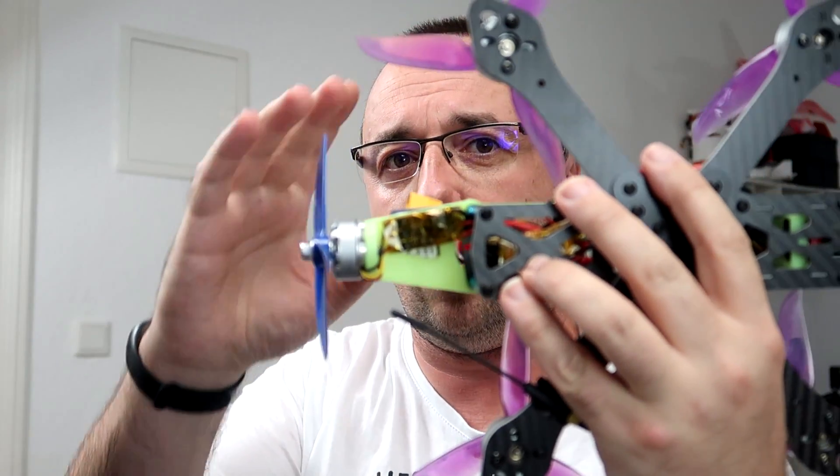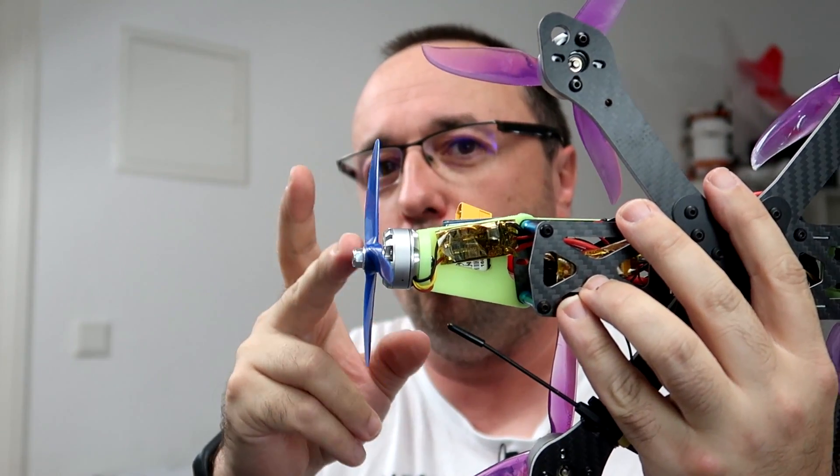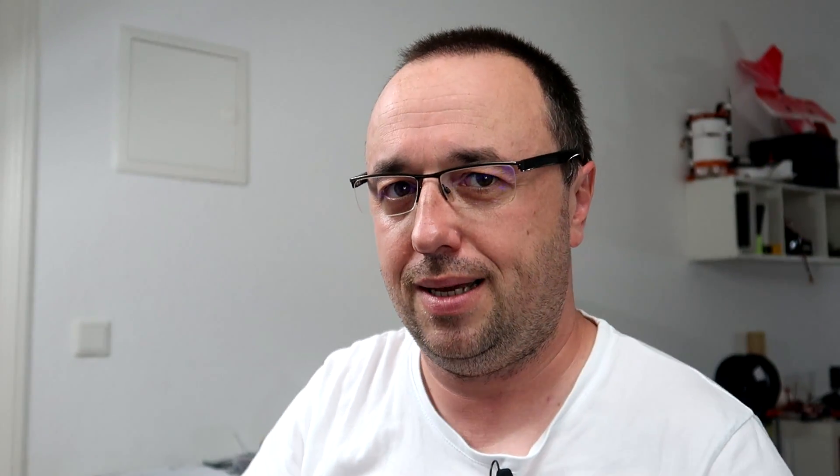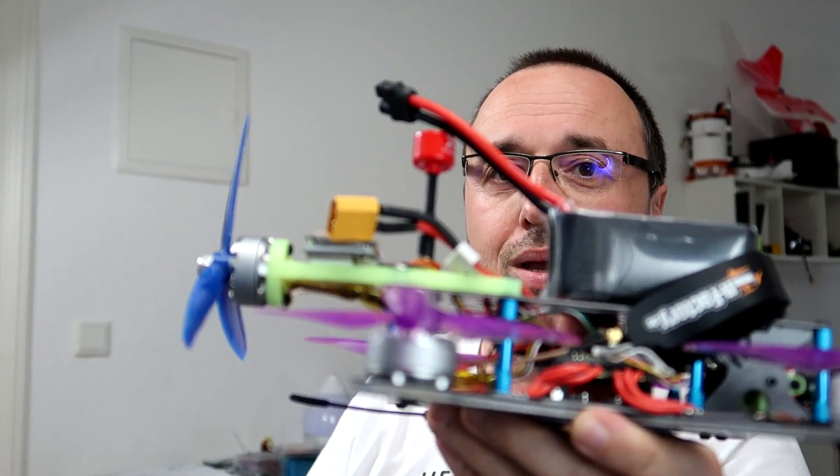There is a problem though. Because of how the arms are installed, I had to move the rear motor pretty far back so it's not interacting too much with the rear propellers. That means this really has a lot of moment of inertia on the pitch axis. The battery has to be positioned far upfront to negate the extra weight from the rear motor. This is why any maneuvers and acrobatics on the pitch axis really suck — it has almost no authority compared to the roll. On the roll it's more or less fine, and the yaw works almost like any other regular drone.